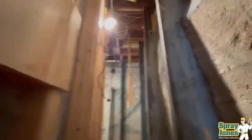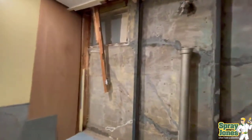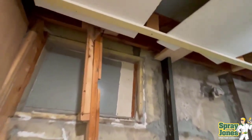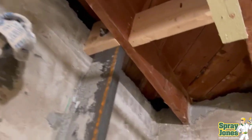A way of dealing with these in situ is to put steel channels and braces, as you've seen. They get pinned into the floor and into the floor joists, forming a steel box of bars. Then they get grouted in so that there's no gap or space between the concrete and the steel.